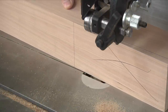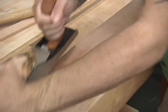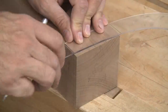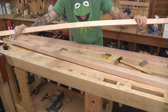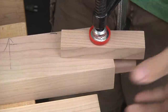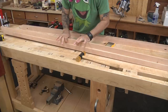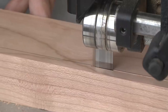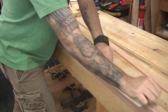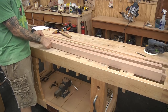Now we'll cut a single taper into the headboard legs and two tapers into the footboard legs. The final smoothing of the taper is done at the workbench. The legs get one more final detail at the top — a slight curve up toward the inside of the bed. The top rails of our headboard and footboard also receive a gentle curve. Using a long piece of scrap, we'll draw the curve directly onto the workpiece. At each end of the rail, I clamp a small piece of scrap at a slight angle and position it so that the bending strip is flush with the corner. Now all I have to do is bring the bending strip up into the workpiece and pull it back a half inch at the center point. The curve is marked with a pencil and then cut at the bandsaw. The final finessing is done using a flexible sanding strip, and putting pencil marks on a surface is really handy as it lets me gauge my progress. Both top rails have the same curve, so feel free to use your first one as a template for the second.